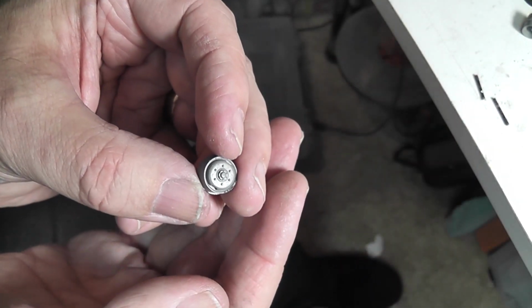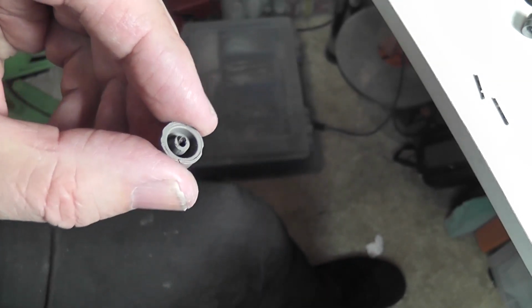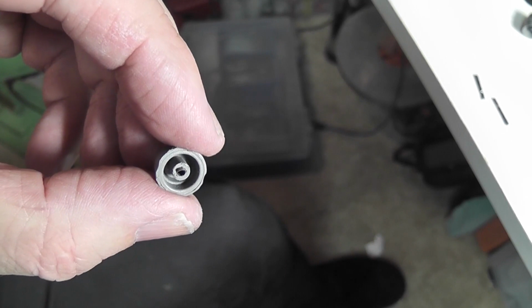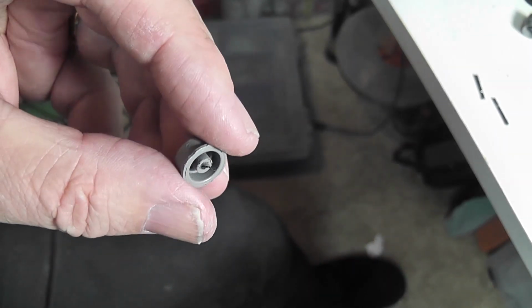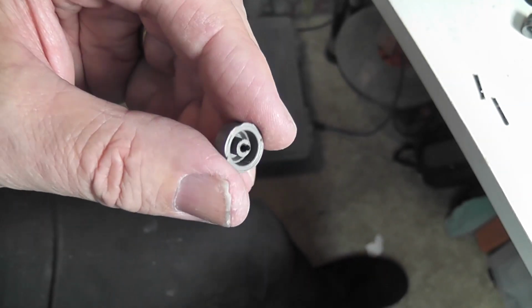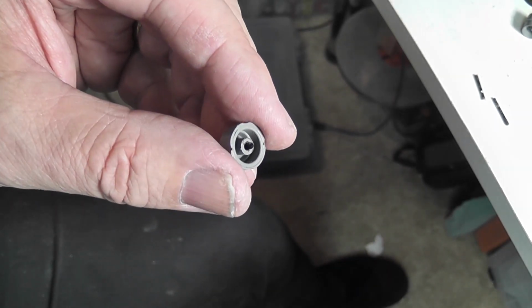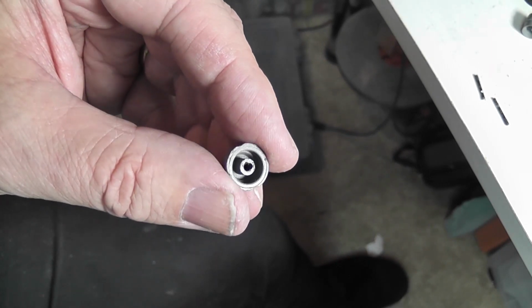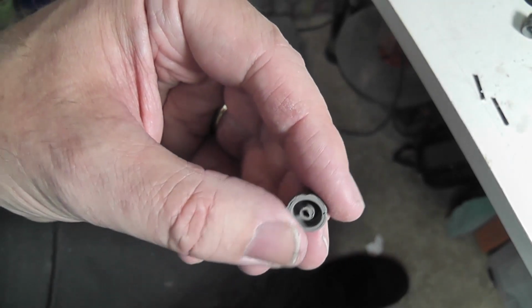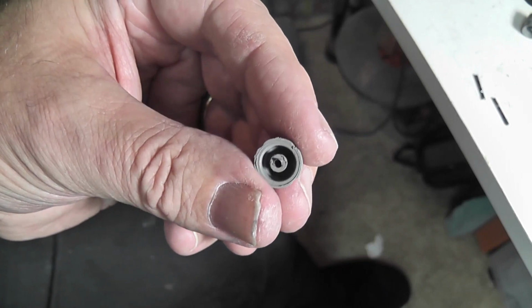The front wheels, that's one of the front wheels, has a very hollow back, which I can't do very much with at the moment, so I need to fill that completely with Milliput. And once I've done that and once it's dried, I can then just pop it in the lathe because that's the most convenient for me, and then clean it up and bore it out for my flange bearings, and that'll be opening it out to 5mm.